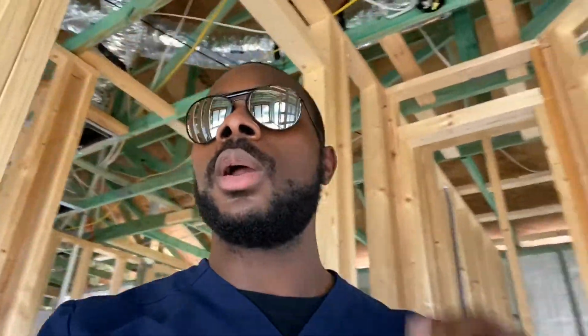This way, there's nothing interfering with the sound for me to project my voice, and then also for the music to come out. And number two, for the Google Home Wi-Fi, in-ceiling or in-attic placement up high is always going to give you better signal outreach in comparison to being down low, okay? So that's the reason why I wanted to use it specifically for the Google Home Minis and also for the Google Wi-Fi. So I just get better coverage for my Wi-Fi throughout the entire home.